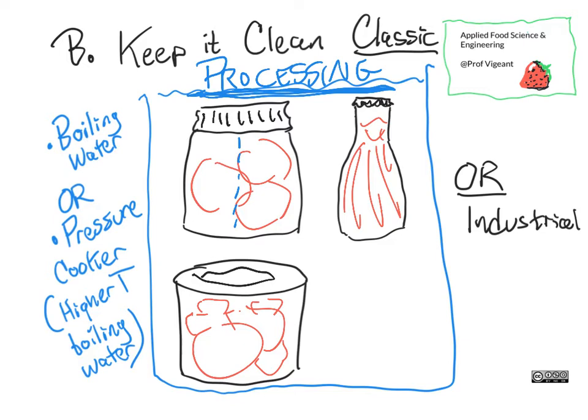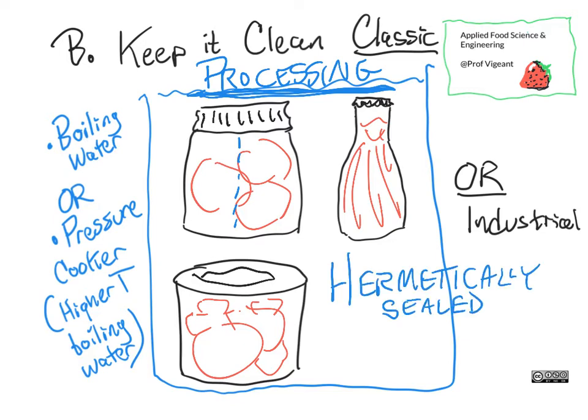What we are trying to do is make sure that our sealed container — what we call hermetically sealed — is not just sealed in a convenient way to prevent spills, but sealed in a manner that prevents bacterial contamination so microbes literally cannot get back in. Cans are not merely lightly crimped; they are chemically bonded shut. For a good jar seal, there is a similar polymer lining doing the job.